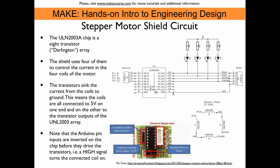Here you see the circuit of the stepper motor shield that comes with the Arduino kit. Down here is a photo of the shield. These are the pins — this is the connector that connects to the Arduino pins; you can directly stick it into the female headers on the Arduino board. This connector fits the connector on the stepper motor. We also have four LEDs that flash whenever we turn on one of the coils. If you want to supply an external power supply, you can pull off a jumper and connect that power supply — important if you run more than one motor with the Arduino.